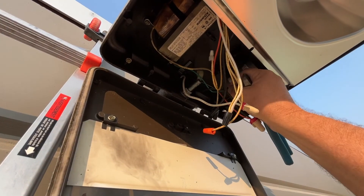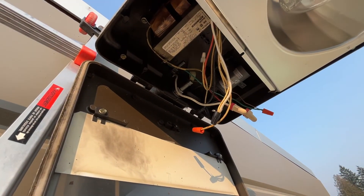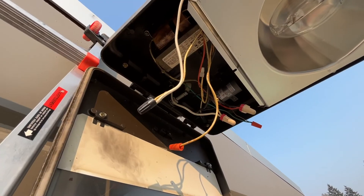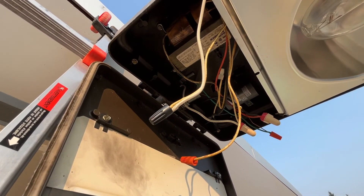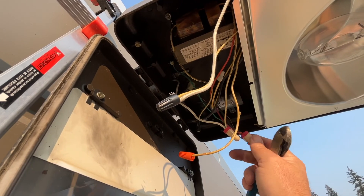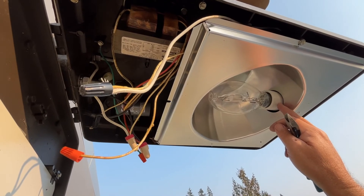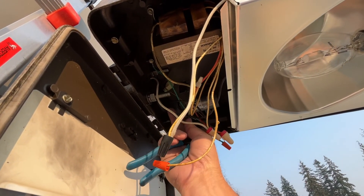The first thing I'm going to do is tease out all the wires, which is pretty simple to do. This is my ground — I'm actually not going to touch that. This ground wire is grounding the circuit with the fixture housing, so I need that and I'll leave it. All I really need to do is get rid of the ballast. The connection is going to the ballast and to the capacitor. I've teased out my neutral and my hot wire. The bulb socket here will have two wires coming from it.